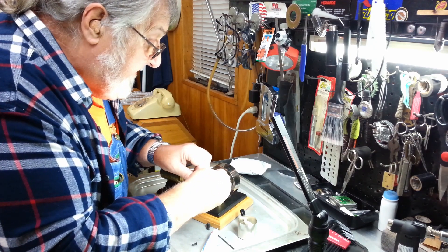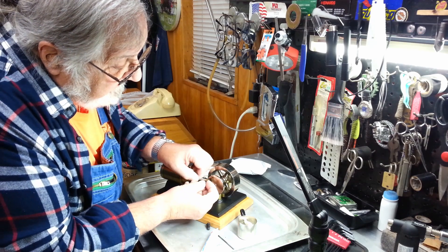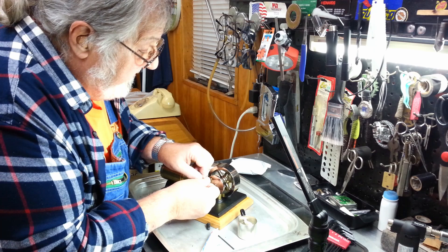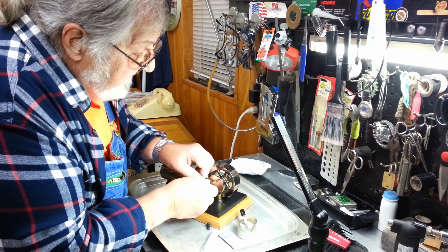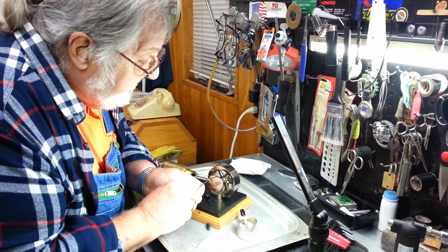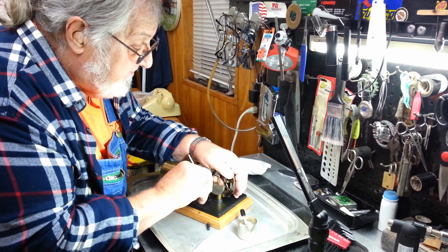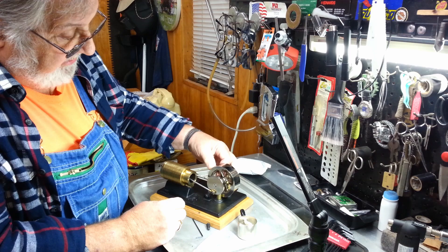Now what we've got to do is bring that out here. We'll put that little bushing back in there, turn it over here a little bit, and ease the screw back up in here. That finger don't work on small stuff — that's why I keep this tray underneath it. Because I have dropped stuff and spent three days looking for it, and halfway through I forget what I'm looking for. I believe we've got it started. That little bushing spaces it out so you can tighten this up and it's still free on there. Without that she'd lock up and she wouldn't go. Actually on a gasoline engine, that'd be called a rod bearing.